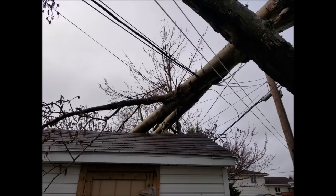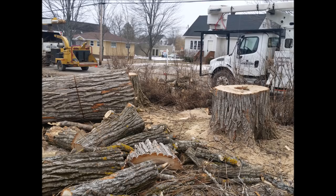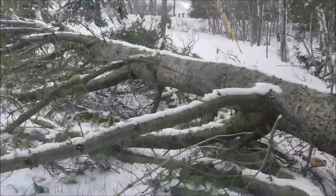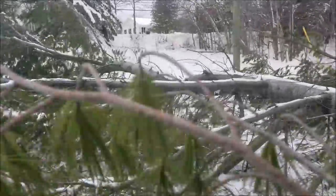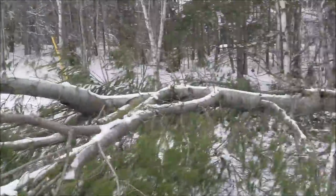Do not plant trees near or underneath existing lines. If there is already a tree on your property that you feel needs to be removed, you can call one of several professional arborists who must also be trained and certified to remove trees and limbs near power lines. Another approach offered by most power companies is we will actually remove the lines feeding your home so that you may safely drop any large trees in the area. Once the work is complete, we will then reinstall the lines feeding your home.